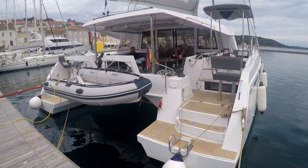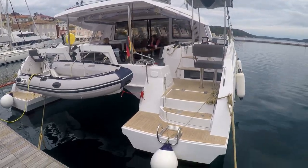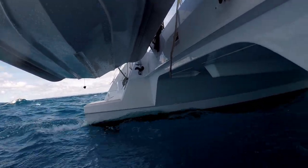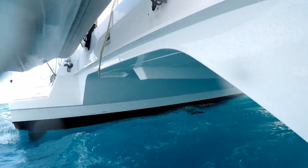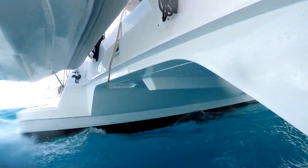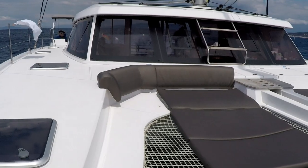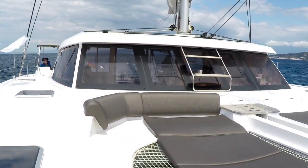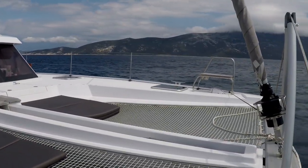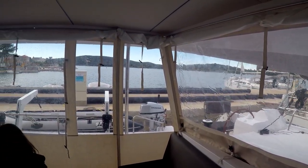The water system really needs to be addressed. Lack of water pressure. I think the boat could really benefit from having a water pump in each hull and accumulator tanks as well. I would increase some of the sizes of the winches and turn them into power winches. The cooktop and the oven were really bad, in my opinion, and should be replaced with better units. Countertop I talked about already, and I have here a total of 23 items on my dislike list. You're free to read these on the cruiser's forum. Again, the link is in the description here.